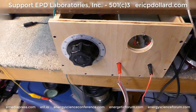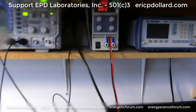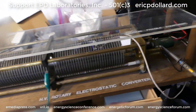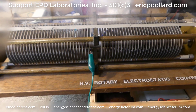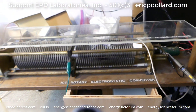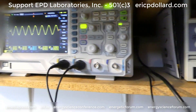This supply is already on — we're on zero. I'm going to bring it up to 1,000 volts, which is 10. We don't really see anything different here. When we get to about 4,500 volts, we actually get sparks across it — that's what I found when I had the DC motor off, spinning as friction-free as possible to see if the plates would offer any resistance moving them out of phase, or less resistance moving them in phase. I'm going to crank this up to about 3. We see 0.61, 0.62 — so that's relatively unchanged.